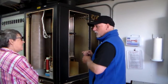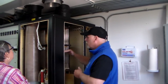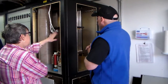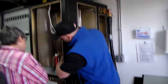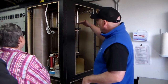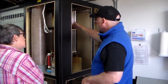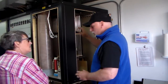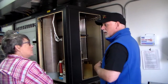And when I tell this thing to tune to a certain frequency, it has to go to that spot. With our test equipment, I can tell you that it's gone to that spot, or I can set it up to make it go to that spot. So this is the frequency determinator? This is one of the determinators, correct. It has to be set up properly to match whatever frequency we're putting into the vacuum tubes, from 2.8 to 10 megahertz. This particular component does fail from time to time, and if it does not tune properly, the RF energy is such that it will melt this. So I have to pull the whole thing out, put a new one in, and recalibrate it.